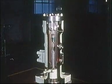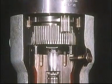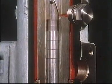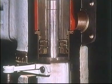Before dismantling, the pump lead must be measured and the result noted down. This is done for adjusting purposes after reassembly. The pump lead is the number of millimeters which the pump plunger is raised from its bottom position when the corresponding piston of the engine is in top dead center.